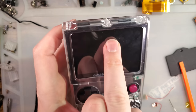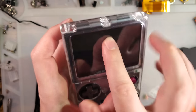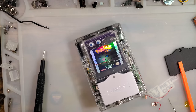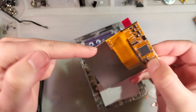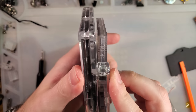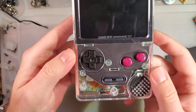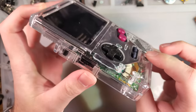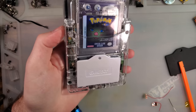And also, while we're there, I swapped out the screen because the original screen, I believe that was actually my doing. I ruined it by putting those two spots in it because I was soldering to the ribbon while it was sitting on top of the screen. You can see here, if we were to attach that and try soldering to it, flip it over, that's right about where my spots were. So I'm thinking that's my doing, so probably don't do that. But otherwise, once reassembled, it now seems to be working exactly as intended. There are still a few things I keep going back and forth, trying to clean up. I did go ahead and install that one screw in the battery compartment. I'd totally forgotten about that while I was reassembling it the first time.